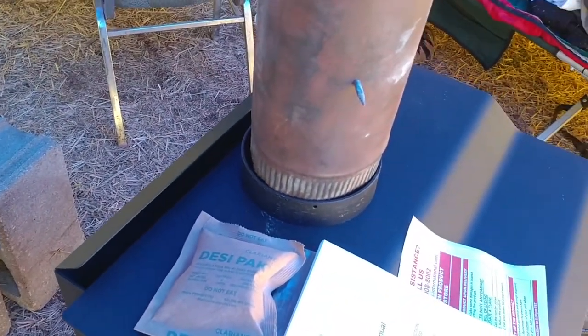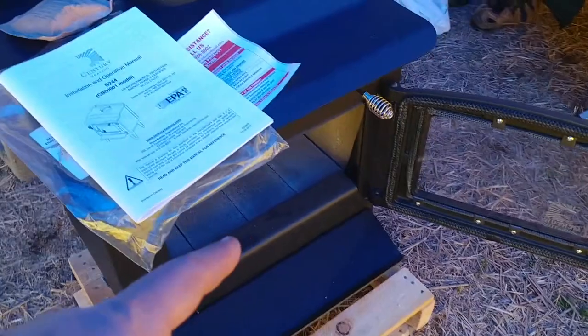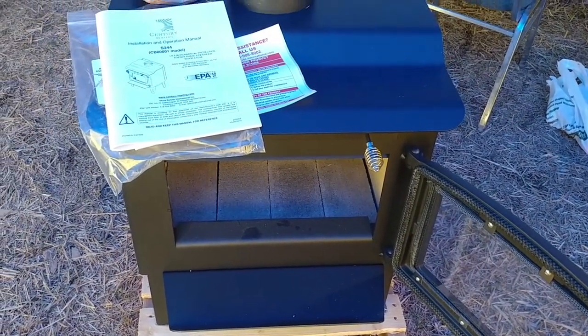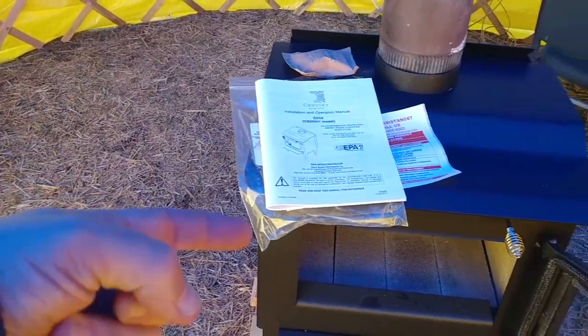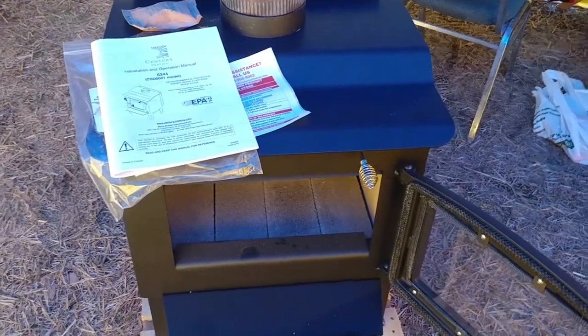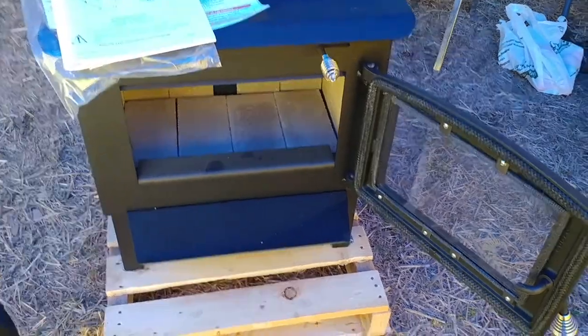There's your draft control. It does have options for a blower - there might be the control thermostat - and the blower unit fits on here and pulls air up through the bottom and comes out here. Since I'm going to be off-grid with solar power, I don't know if I really want a blower on there, but I might explore that option and see if I can get 12 volts. It also has a package where you can pull the draft air for combustion from outside, which would be better - that way you're not sucking your warm interior air into the stove and up the chimney.